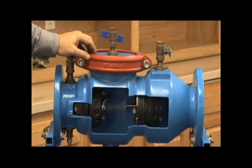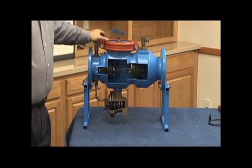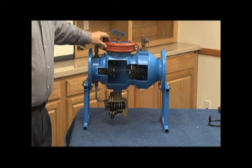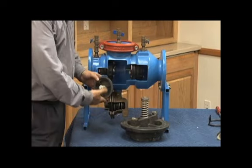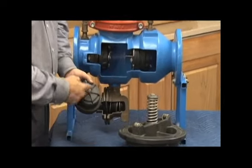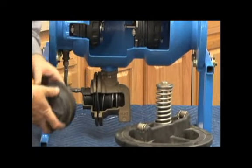And again, the corresponding 350 backflow assembly double check version from Wilkins, produced in sizes 2.5 through 12 inch on double check and 2.5 through 10 inch on the reduced pressure assemblies. For a point of clarity, here's what the 3 inch check looks like, held in by those same type of clips, but only one bolt on the backside or nut on the backside is removed to change the check disc, as opposed to 4 as we saw on the 4 inch.